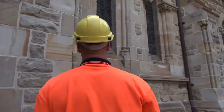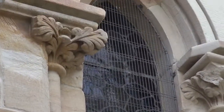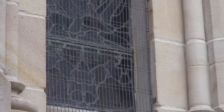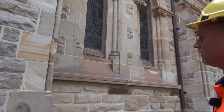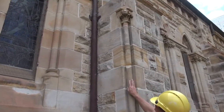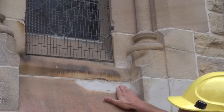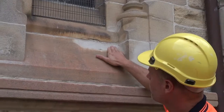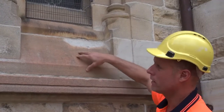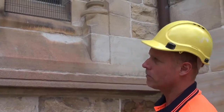Just to note, the windows have been fully cleaned and resealed — our heritage lead worker and glazier came in and did a really good job on those, and they're still in very good condition. You can see here more elements that have eroded away — that would just be water damage coming off the windows. There's no point putting a new piece of stone in because the stone itself across the whole face is still in good condition. We just rub that back to what we call sound stone, and then point it back up.